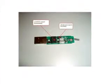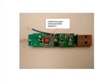Here's the corresponding dongle for that same presenter. And what we're going to see here is there's a microcontroller as well that's going to double as the USB chip. So whatever data it gets and it decides that it's valid for that device, it's going to package it up in the USB packets and send it through your port, up through the host chipset, through the stack, back up to your computer. And here, again, we see the serial EEPROM. So this is the same authentication data. If you want to compare it to, let's say, Bluetooth, these devices are paired at factory and cannot be repaired. And here's the receiver chip for the device. That's going to operate on the same band, and it's receive only. So once again, one-way traffic.